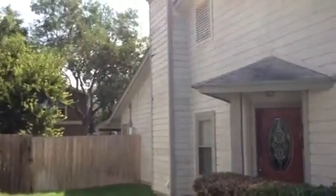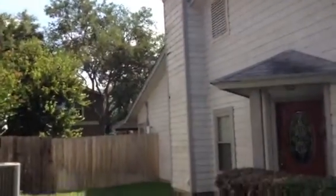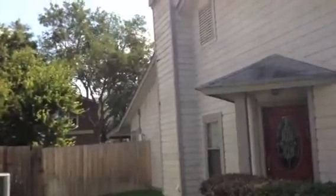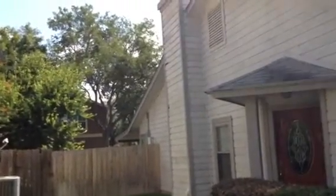Looking at doing soffit. It's about a 1.25 foot soffit. We have a 1/2 inch fascia, so we'll do a fascia replacement with a drip edge replacement. There is no metal drip except for on a patio cover in the back, so everywhere else is just basically tearing off, installing the Hardie fascia, and then doing a 1x2 drip Hardie.